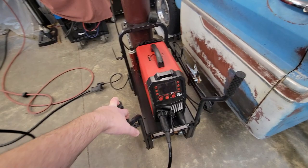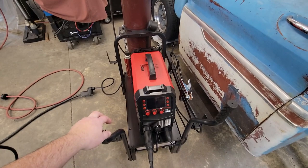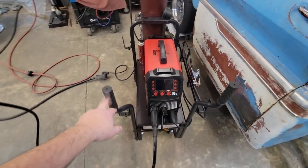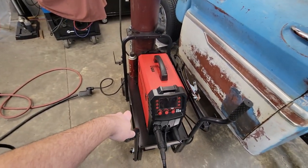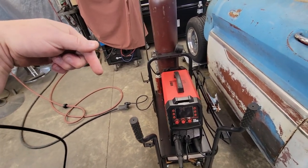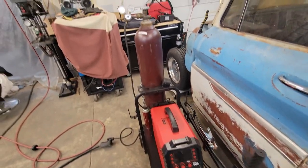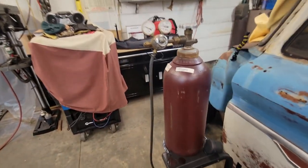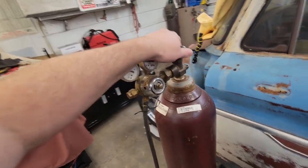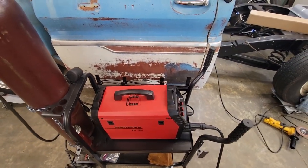I love it, works good. I got a discount code in the description below if you want to scoop one of these up. Like I said, this machine will do a lot — it'll TIG weld, stick weld, and MIG weld. It does it all and it's very affordable right now. Go check one out; I got the links down below to save y'all some money and help the channel out. We got it on a 75/25 argon-carbon dioxide mix at about 22 CFH, and we're running .030 wire ER 70S-6.